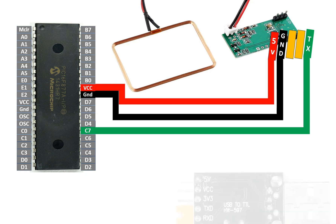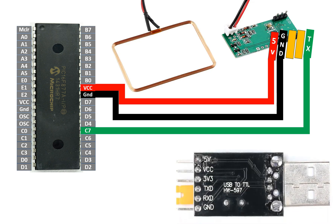To display the output you can use an LCD, a touchscreen, a Bluetooth device — whatever you prefer. I'm going to use a CH340 USB2TTL device and send the data to the computer. In a future video I'll show how to use an HC05 Bluetooth module to send card data wirelessly. But right now I will use the USB2TTL device to display the data on the computer — the PIC will receive the data and then send it using the USB2TTL device.